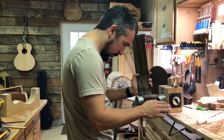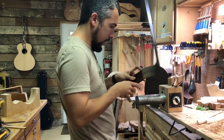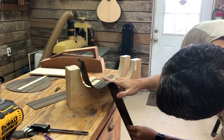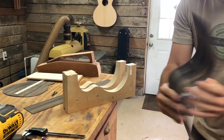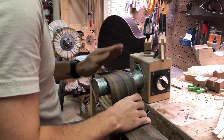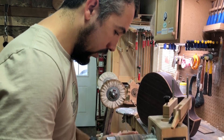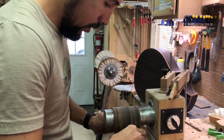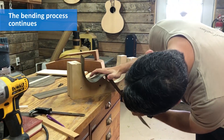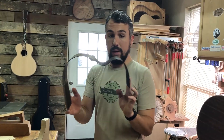You just work the wood like a clay maker makes a pot — by eye and by feel — and get it to the shape it needs to be in. Let me test it to see how it's looking. You can see everything is really overbent right now, but we're getting close, so just keep working. This whole piece is really oversized as far as thickness for what the ukulele will be, but you do that step later. Now it's looking a lot better — we're getting there.